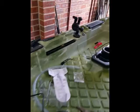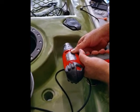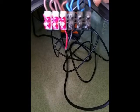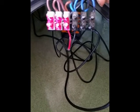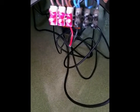Now we're going to run our power from our 7 amp battery mounted in our crate through the hull. We've run our cable through to a terminal block. The sounder is already wired into the terminal block and we have a couple of spare terminals that we will run the USB power cable for the phone into later on. I'm going to mount that terminal block inside the hull simply using a little bit of liquid nails, and there we see the terminal block now mounted.